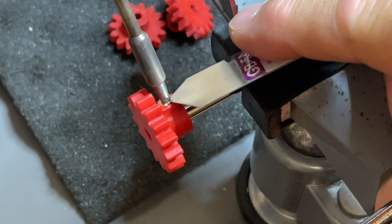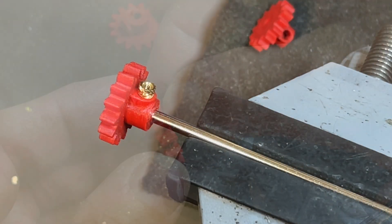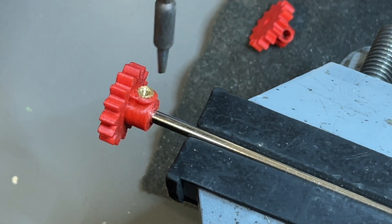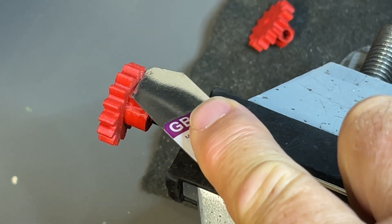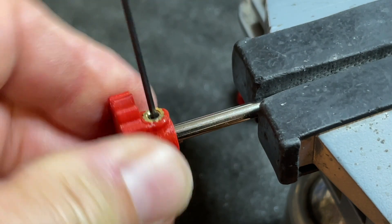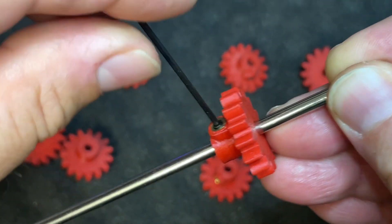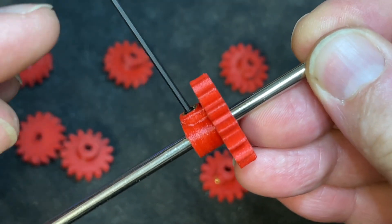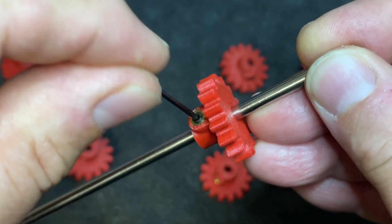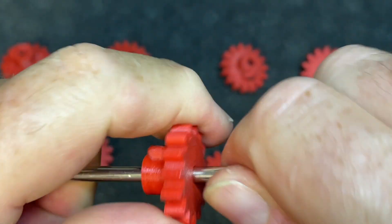The enormous advantage is that the angle of melting is not extremely critical — it can deviate by a few degrees without any problems. And that's not something that applies to the possible metal shafts we saw a moment ago, where the angle must be exactly in line with the wheel axle, so you'd probably need a special tool to align that. So I'm very happy with this simple and cheap idea. The result really exceeded my expectations. The Allen screw can be tightened very hard, allowing the wheel to be fixed very tightly to the axle. This is of course much stronger than the thread tapped directly into any 3D printed material.